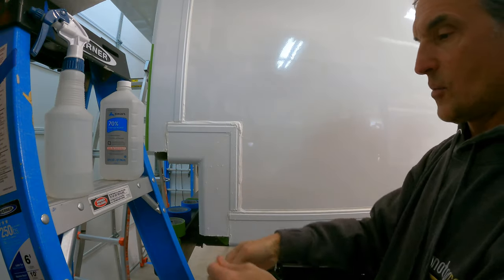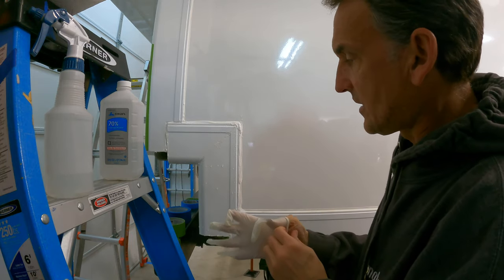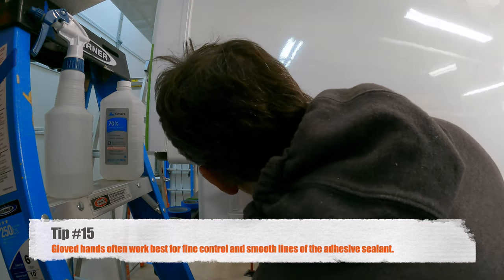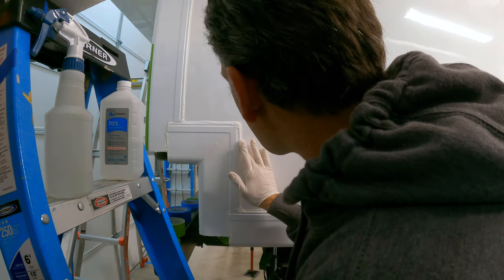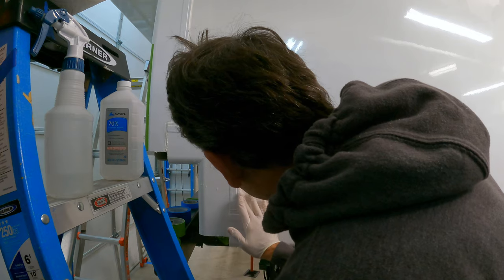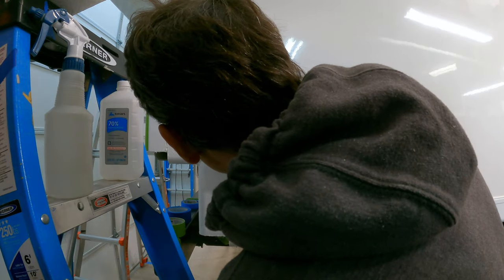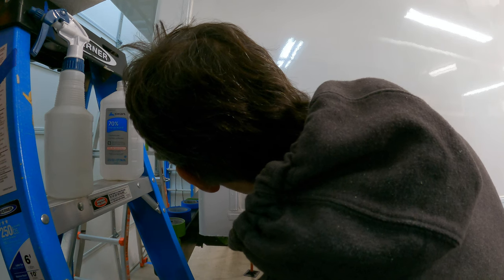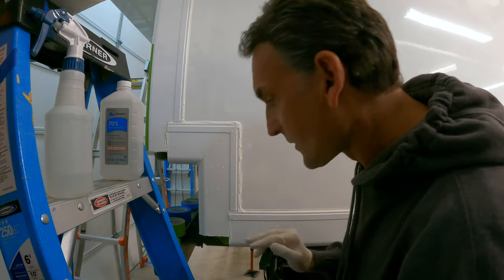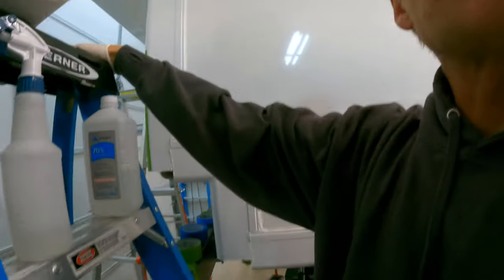Now I'm going to put on a disposable rubber glove and use my finger to really smooth out the remaining sealant here — I have more control this way and can get a really nice edge. There we go — that's nicely smoothed out, much better than it was. Now I'm getting the look I wanted, making sure the seam is covered and nice and smooth. While I've still got this glove on I'm going to go take care of the tape up at the top — that one's going to be another tricky one.